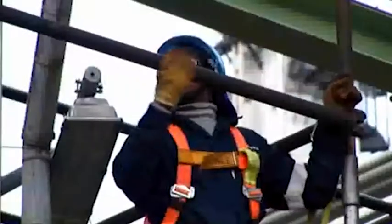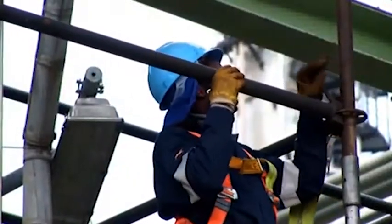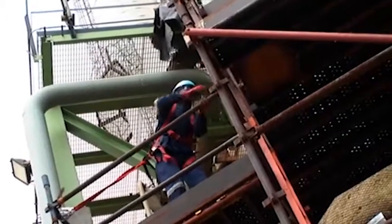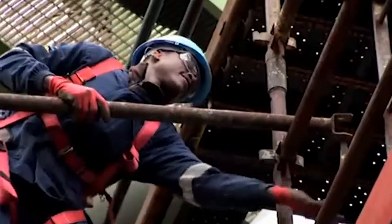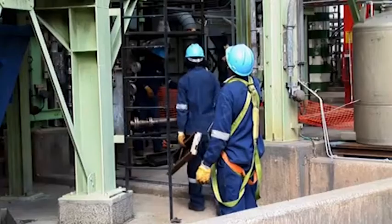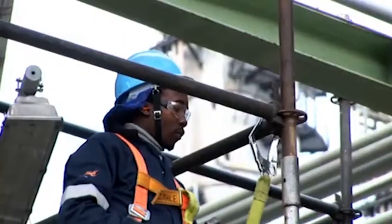Only competent scaffold builders with the necessary permit may modify scaffolding. A handrail may never be removed without a grating removal form and necessary permit. Where handrails have been removed, this must always be replaced with a hard barricade for the duration of the handrail being out.